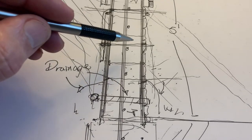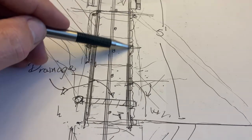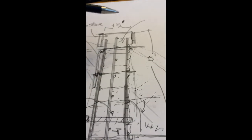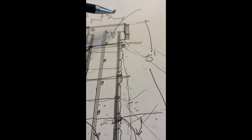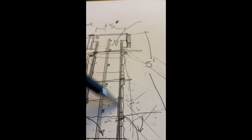You have only maybe in each of these panels about a 7-bag to 8-bag mix. For a 30-foot wall going back, you'll have 30 times 5, it's gonna be 150 square feet, divided by 40. So you have about 3.75 panels. If you have 7 bags to a panel, you can use 8 bags if you wanna make it thicker, it's up to you. But let's say you have 8 bags, you have close to about $1,000 in panels. Okay, that's what that's gonna cost you.